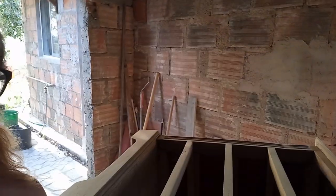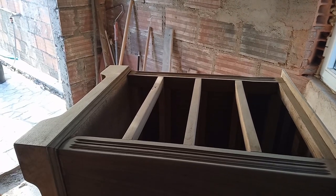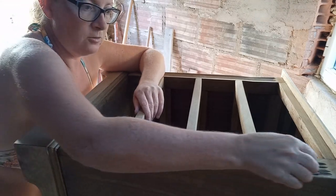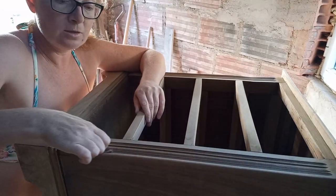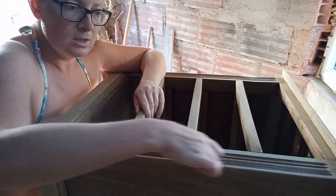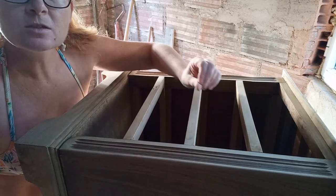With any wood that is not treated, so it doesn't have wood stain or wax or some kind of coating protection, if you get water on it, then the grain of the wood is going to raise. So that is what I'm doing right there. You can see it doesn't take much and it is nice and smooth.